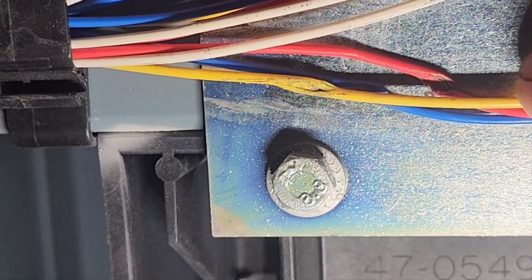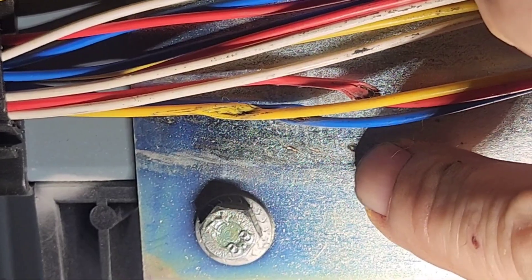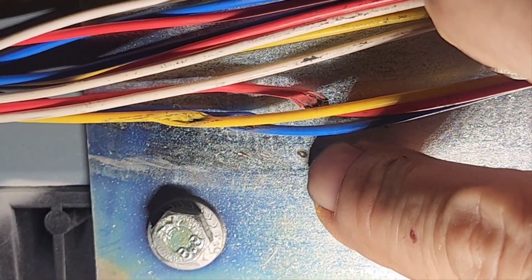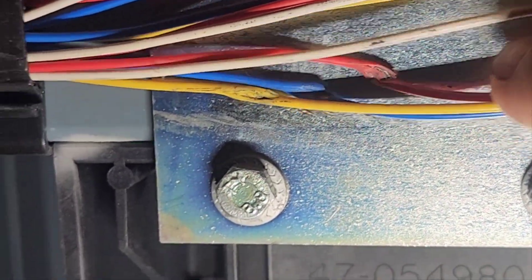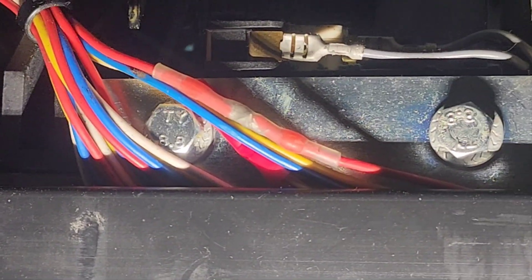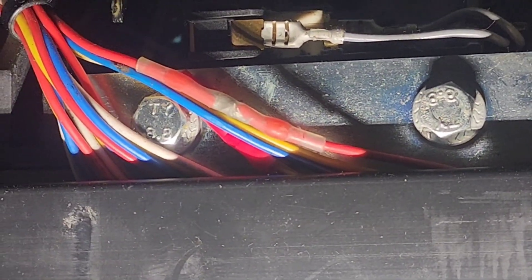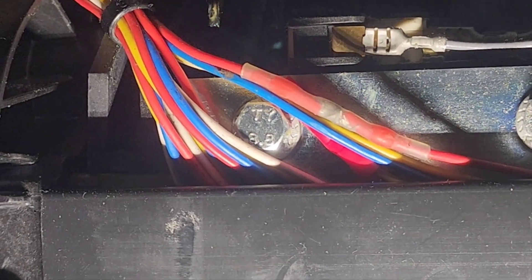You can see these wires — red, blue, and yellow — all got smushed somehow. There's evidence right here where we had voltage to ground, so that's going to be our short. But we're not going to give up there, we're going to keep looking, because over here we had a previous issue where we had to patch a couple breaks in the wires.